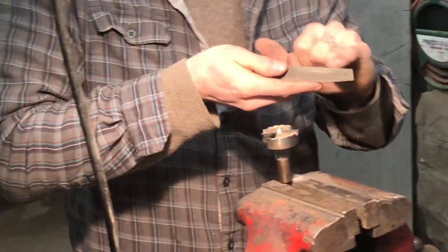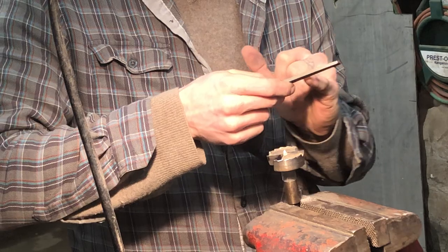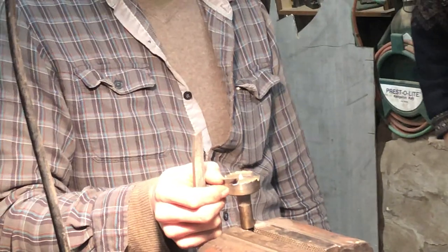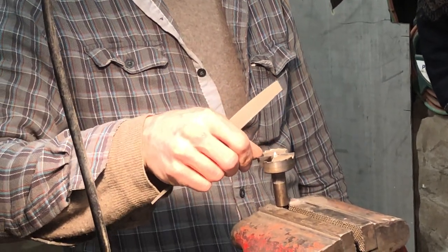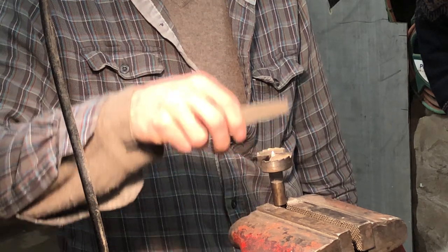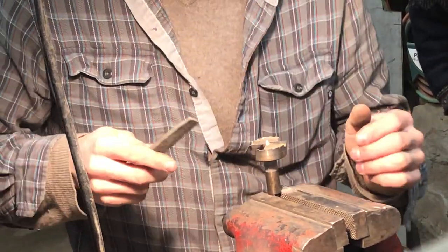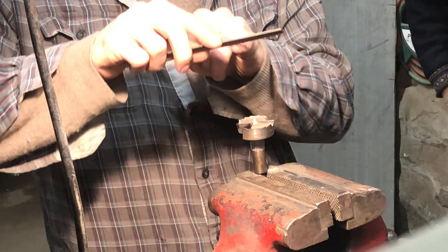The other thing, again, with that whole idea of where you have teeth on a file, when I'm sharpening this, I have these teeth that are on this face down. So this, in terms of handsaw sharpening, is the gullet, if I remember correctly. Is that right, Kevin? So I'm continuing to keep this notch the same depth by keeping these teeth here filing down as I'm filing these vertical faces, right? So that notch isn't becoming shallower and shallower. Does that make sense? Or that angle starting to change because I can't quite get into the corner with the toothless side.